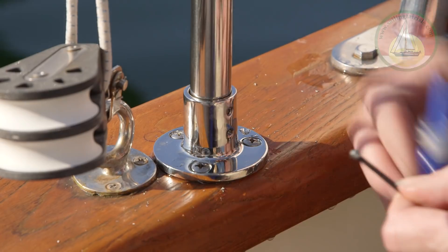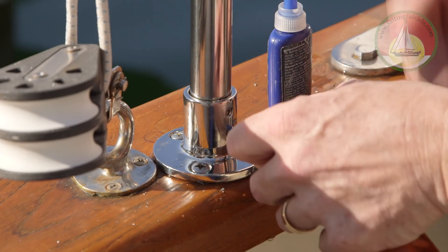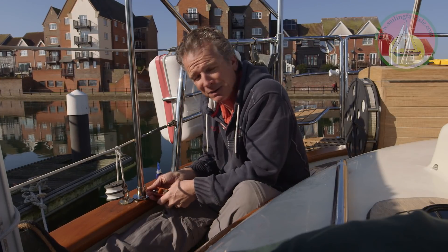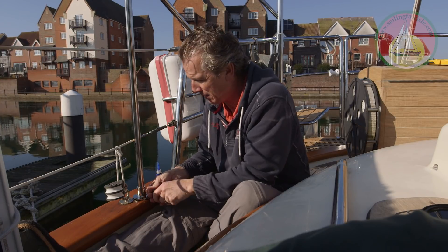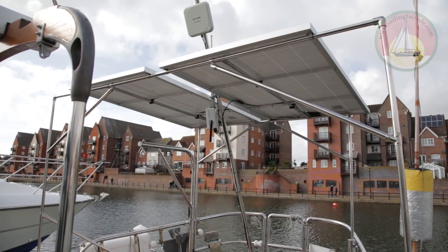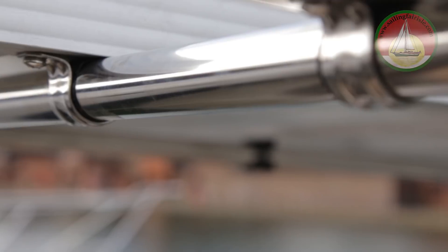A little bit of Loctite on each one. So now I've got the longer screw going all the way through making it impossible for the pipe to pull out, and the lower one tightens up against it to stop any movement — I think that's the best of both worlds. We've also got quite a bit of cross bracing for stabilisation, as well as some square section pieces of aluminium on the panel to clamp them down mid-panel, in addition to the saddle joints around the edges.